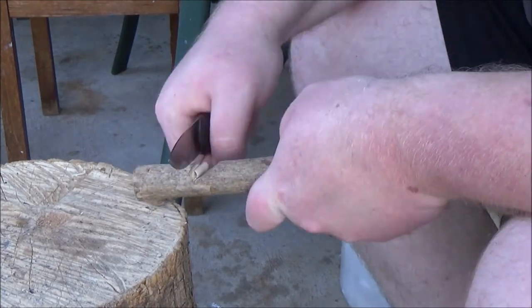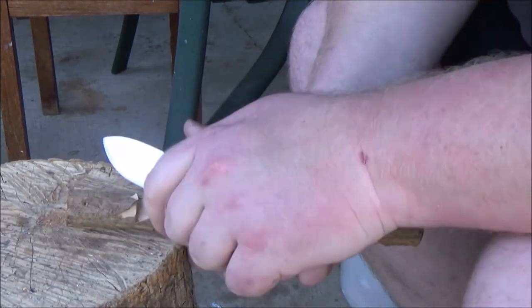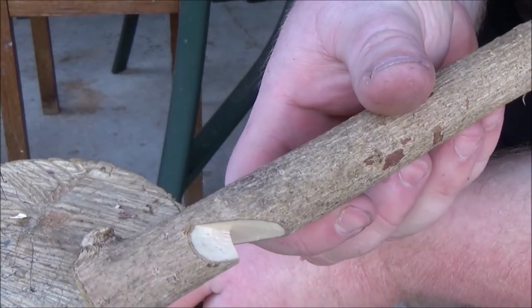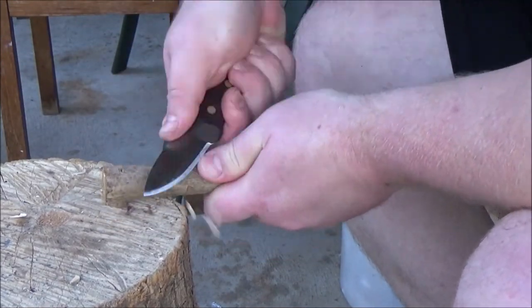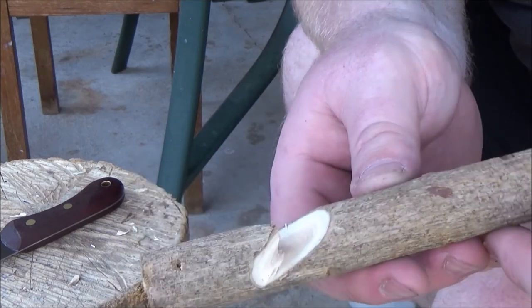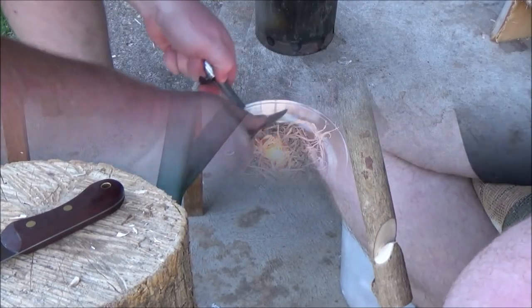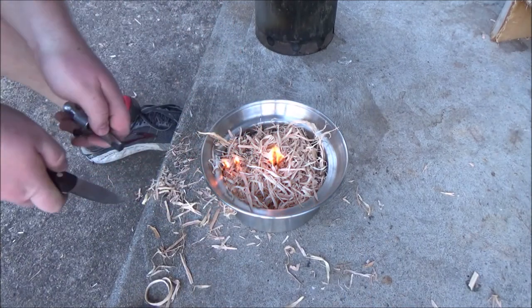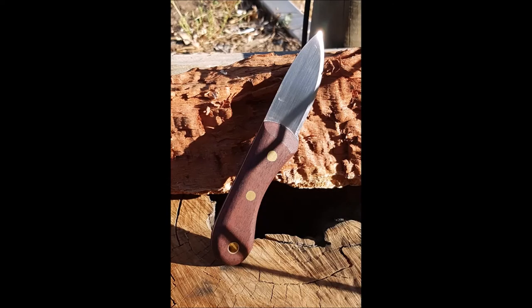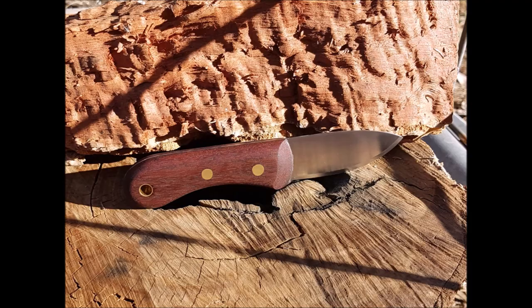Carving a notch here — this bit of wood was harder than I thought, so it took longer. The spine was a bit sharp but that's because all the steel was only about a millimetre thick. It still worked as a good little knife. I'm making a pot-hanger type notch, and I was quite surprised with how it did. I cut the burr off after this with a ceramic rod and it came out way sharper. It doesn't strike quite the best on a ferro rod because the spine isn't completely square, and being so thin it's kind of sharp on your fingers — a 2mm-plus blade thickness would be a bit better. Thanks for watching, and I hope to come out with a new one every couple of weeks.